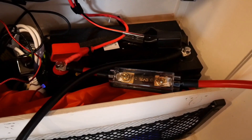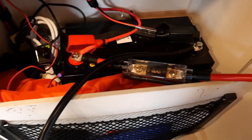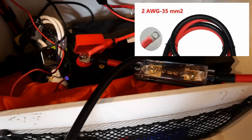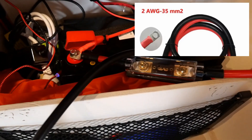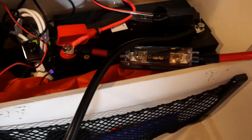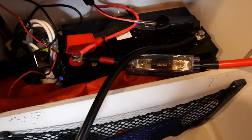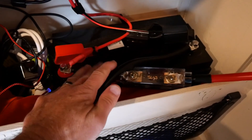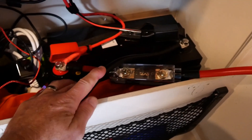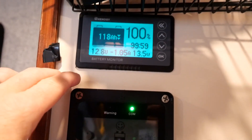One very important side note: these cables are size 2 AWG, 35 millimeter cross-section. These are not the cables that were supplied with the inverter from China — they supplied something about half this size, which is not adequate. On this cable we're going to have up to around 130 amps of DC current flowing when we do the test, and you'll see that on the clamp-on meter.